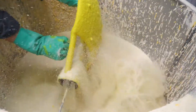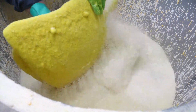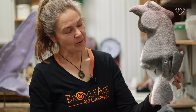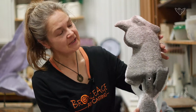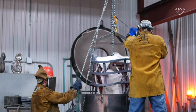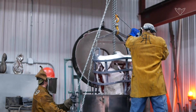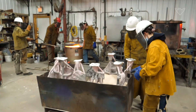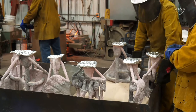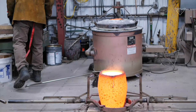When it's complete and dry, it'll get put into a kiln, and the kiln is utilized to melt the wax out of that system. That wax can be reclaimed and reused. What's left is a hollow ceramic shell — we call this a ceramic shell or shell mold — and that's the space into which we pour the molten bronze. We'll burn the wax out.